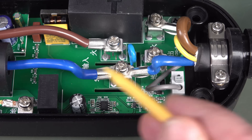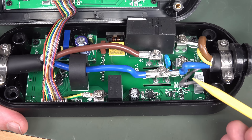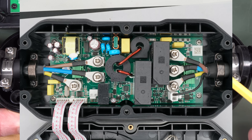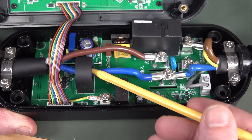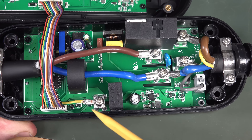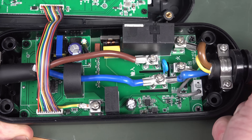We've got a common neutral here and they're just relaying the active. I put up a photo of the other cheap unit I had, and it had two relays — one for the active and one for the neutral — plus a core balance relay. But here there's no core balance relay. They're not switching the neutral through the relay; they're only measuring current on the neutral side. I think that's how they're getting the cost down — they're skimping a bit. There are some nice isolation slots, so they're doing some of the requisite stuff, just a simpler design.